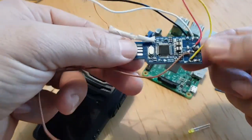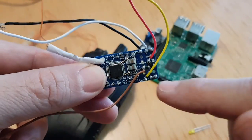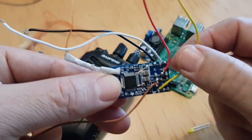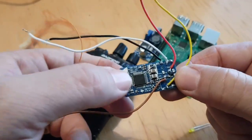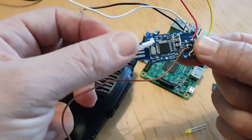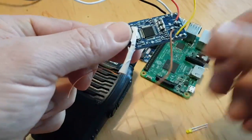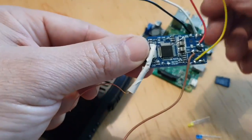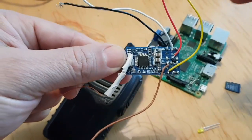And so it saves a lot of soldering, because there's quite small soldering to do on here. You've got a couple of resistors to solder in. There's a transistor in there, which connects to three connectors. You've got some fine connections here. These two wires coming downwards are for the LED. These four are the ones that connect to the radio, and they're all important anyway. So they're the ones you'll see me soldering to my radio.